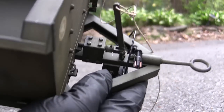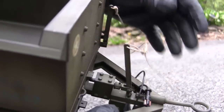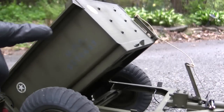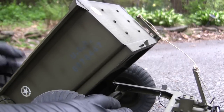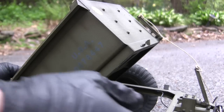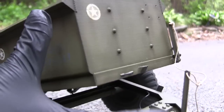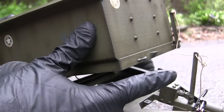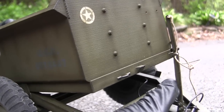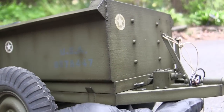The piece is what's used to lock the unit in place. If I pull on the lever, the pin retracts and now this allows the bed itself to hinge downward allowing the contents to flow out. When done, you simply just hinge everything back and the piece, if you notice, is angled so that it should automatically knock the component back and lock it in place. Just to prevent the paint from scraping, I'm going to hold it back manually and let it go, locking everything back as one unit.